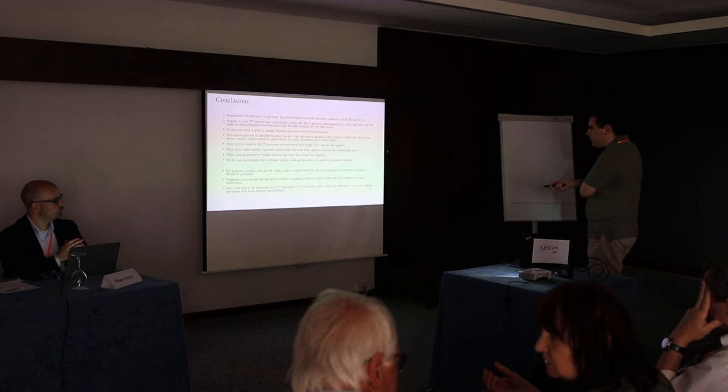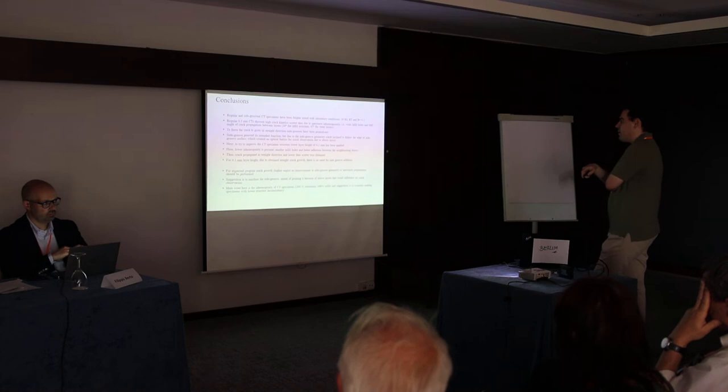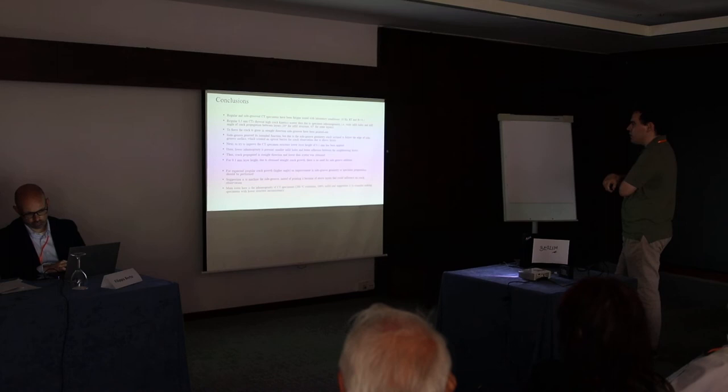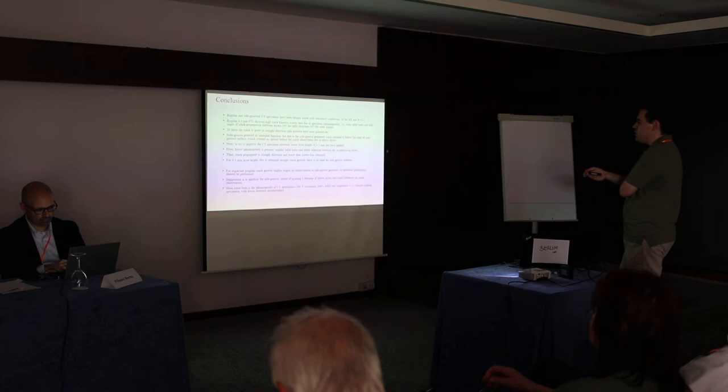So we did test some CT specimens with 10 Hz frequency at room temperature with an R ratio of 0.1. We first started with 0.3 millimeter thick layer CT specimens. We obtained high crack kinetic scatter due to specimen inhomogeneity. As I've shown, there are wide infill holes on the fracture surface and different angles of crack propagation between layers: 30 degrees as we've seen in the infill structure and 45 in the outer layers. So the result was pretty bad.